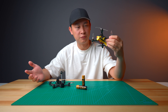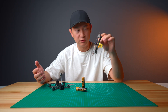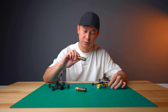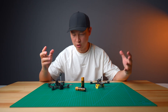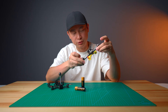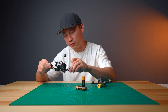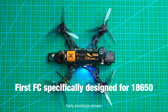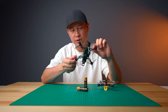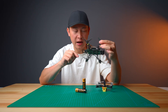It's using the Hummingbird V4. The Hummingbird V4 for whoop is pretty good — the MOSFET can hold up very well. But with this motor, if we want to unleash all the power from the Nitro Nectar Gold, it's not enough. When we do the test with this battery, this drone cannot pull even 25 amps. So we made another flight controller — it's actually the shape of a 18650 battery. We are probably the first in the industry to make a flight controller shaped and dedicated for a single 18650 battery cell.